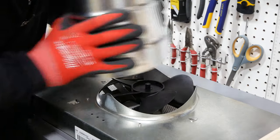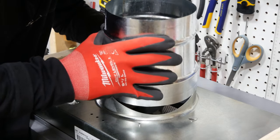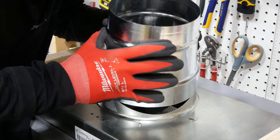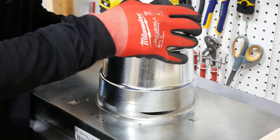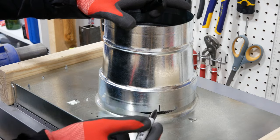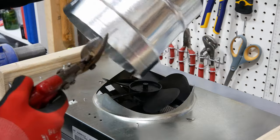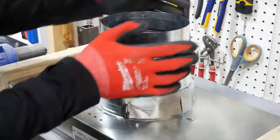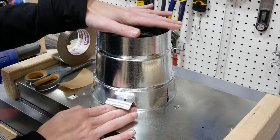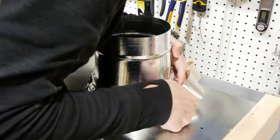The exhaust from this fan unit is 7 inches in diameter, which is not a super common size for ducting, so I wanted to reduce it down to 6 inches as there are a lot more adapters sold for that size. The reducer didn't quite fit at first, so I made evenly spaced marks around the base of the reducer and made relief cuts with snips, adding more cuts until I could get it to slide over the collar of the fan unit. I covered the relief cuts with foil tape and then taped the seams between the reducer and the fan unit with a couple layers of tape.